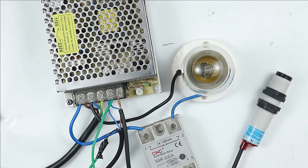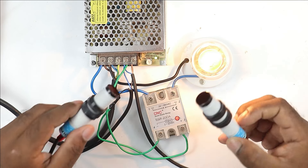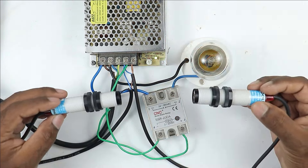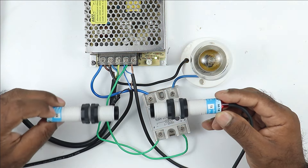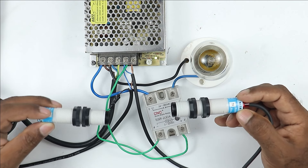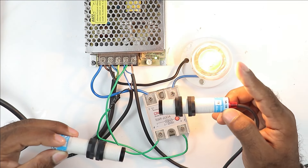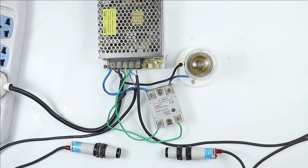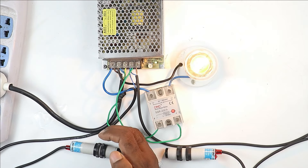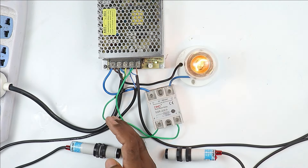Now, this whole electrical wiring is completed. We just have to check its complete working. I am providing power supply to my SMPS. At the moment, you can see that this lamp is in on condition, because I have not aligned these two sensors together. In a laser sensor, a laser light comes out through the transmitter which we have to receive on the receiver. If the alignment of these two is straight — that is, if the laser beam comes out and is received in the receiver — then our lamp will be in off condition. But if the alignment is wrong, the load will be in on condition. So, I align these two here. At the moment, you can see that my lamp is in off condition. Now, if any target comes in between these two sensors, the lamp will turn on. And when the target is removed, you can see that the lamp is off. As soon as the target comes here, our lamp will turn on, and when it is removed, the lamp is off.